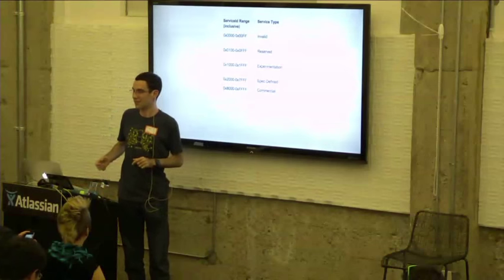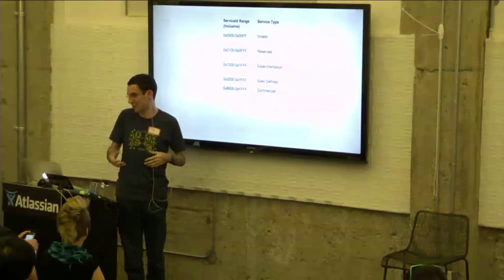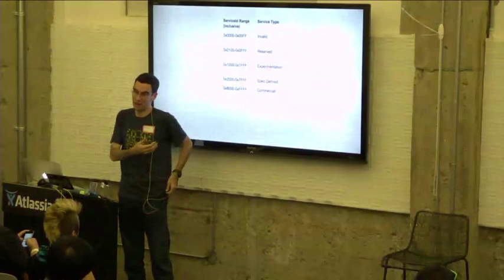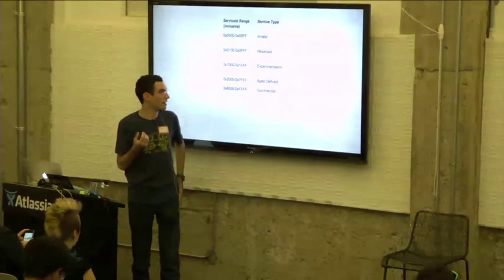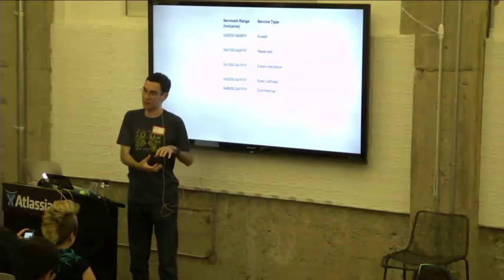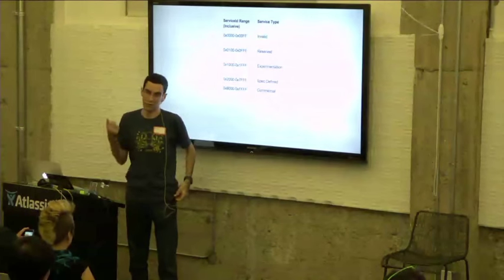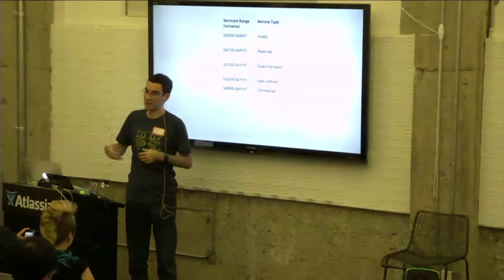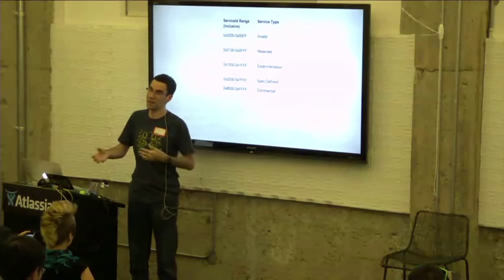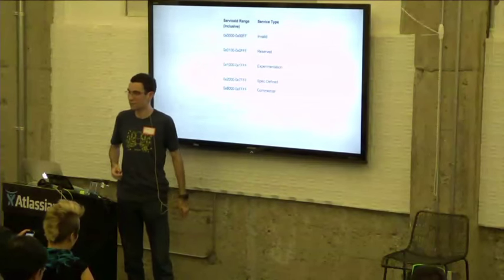Can you repeat the question? Oh, sorry. The first question was, what's the purpose of the invalid range? The invalid range is for things that we might use for other purposes, not necessarily the generic service. The reserved range is for internal things where we actually do implement those services, but we're not exporting them to third-party developers. For instance, when the smartstrap connects, which I'll get to in a minute, it does service discovery. It figures out what services the smartstrap supports. And all that communication happens with services and attributes within that reserved range.